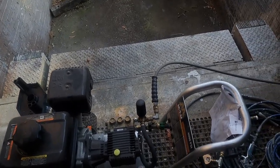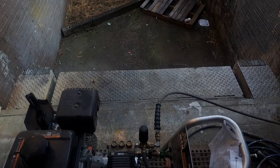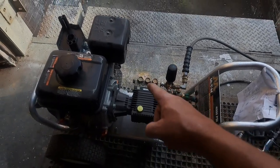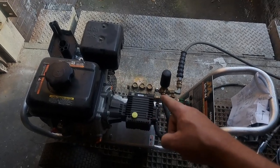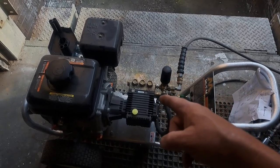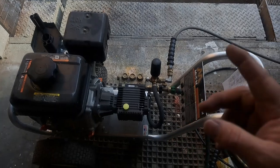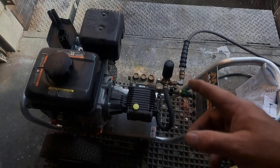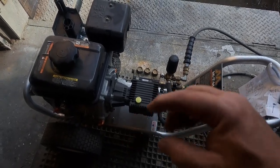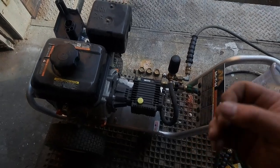Initially when I was running this, the pressure was good — sitting at about 4,000 PSI. When I pulled the trigger, the pressure dropped tremendously and it was rattling. That rattling is called cavitation. What happens is your pump is not getting enough water, and that actually causes the water to foam inside, creating that rattle. It will cause damage over time if you keep running your pump this way. I had to go over and realize my water was not turned all the way open to get maximum water to the pump. The pumps have to have enough water to run or else they will cavitate.